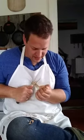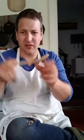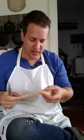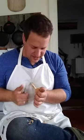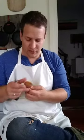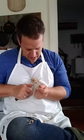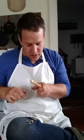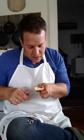All right, now at this stage, I'm going to leave this keel pretty strong. It's easy to overcut this keel on the back here because it's a very powerful cut that you're doing here. Super powerful, and it's easy to overdo it, but you need that because let's say when you're running facets down the handle, you end up taking off more than you realize, and your handle is now super, super thin. You're going to wish you had left that keel.